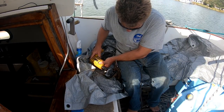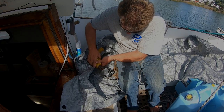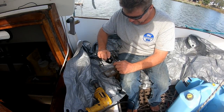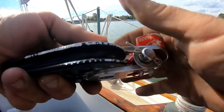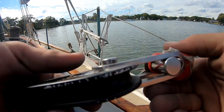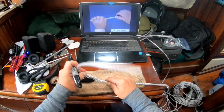I'm going to replace them with 7mm Dyneema Dux. However, one hitch I ran into right away is that the thimbles for the Dyneema Dux, which takes a 7mm and a half-inch pin, will not fit inside the jaws of standard rigging toggles that take a half-inch pin. So that's why I'm grinding away at these thimbles with an end milling bit freehand with a drill, which is probably not a recommended practice.